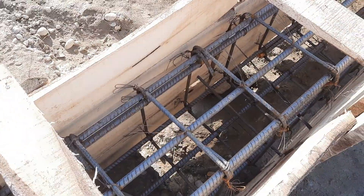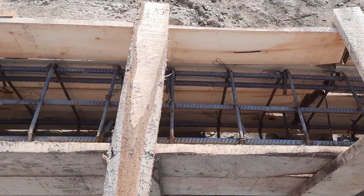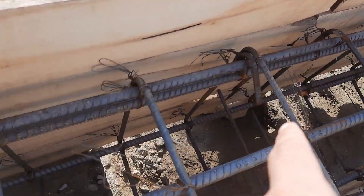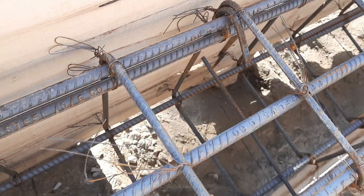There are two side bars with a diameter of 12mm. The middle bar is also 12mm, and the main bars at the bottom are 16mm. You can see the hooks are bent at 135 degrees with a length of three inches.